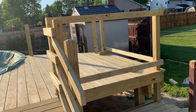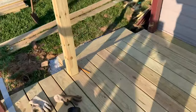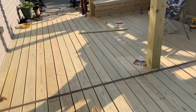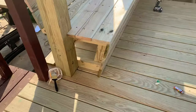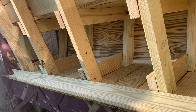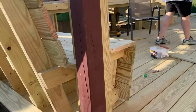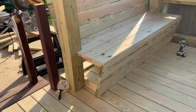Put a rail up on the steps and we're gonna see what we're gonna do about some corrugated. I'm gonna put a step down here. This is kind of an afterthought, just to see if I could build it. I built a bench. Leaning in there. And just 15 degree cuts all over the place. A bottom piece, a middle piece, a long piece that goes up here, and a short one for the front, 18 inches off, 18 inches high, and then just decking boards across. Super, super easy build.